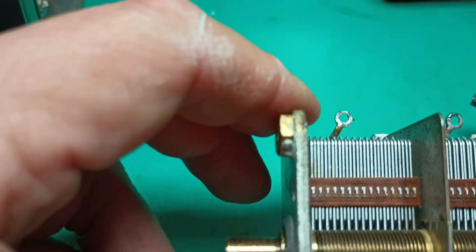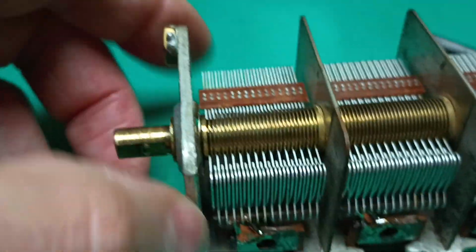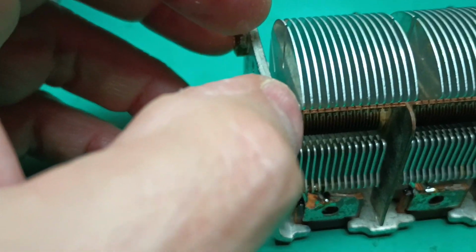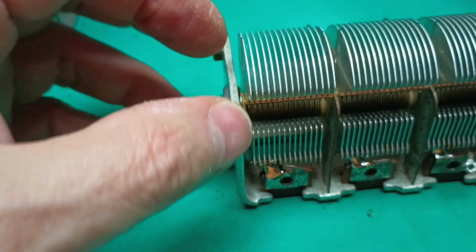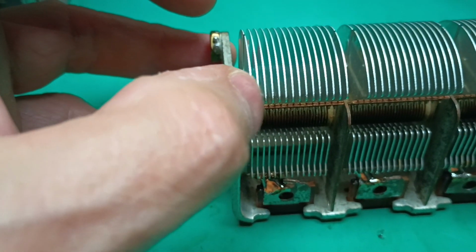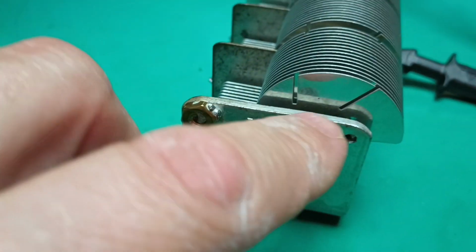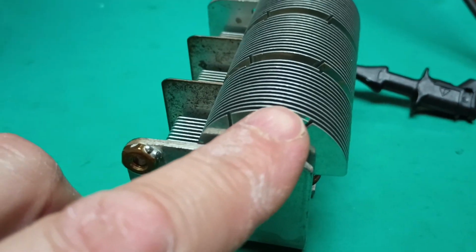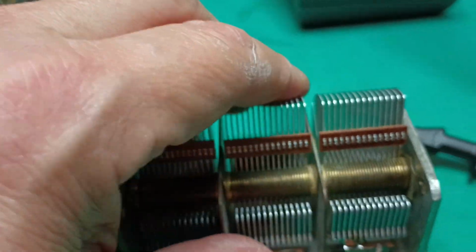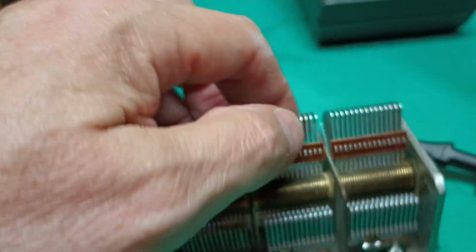After that's done, go along and look for symmetry, even spacing. This is real nice. But occasionally a plate is off. If a plate is tipped a little bit, you can open this up and very, very gently, these can be pushed or pulled either side with very light force from your thumbnail. And they can be just coaxed to go back into position. Don't bend these. These are for band spread adjustment in receivers, mostly for oscillators. That's another miserable operation to try to set. But those are what are bent to correct for tuning band spread across a dial. That was a thing in old receivers.